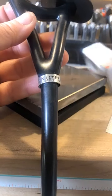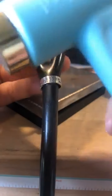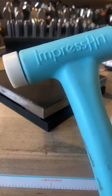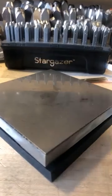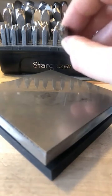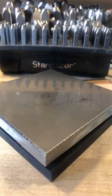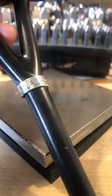The Argo angle hammer — you cannot switch out these heads. This hammer is strictly for metal stamping. This multifunction hammer here is the only hammer that you can put different heads in. The signature stamp set I'm using today is rated for stainless and they're tapered, cleaner, and sharper. Your regular stamps in the colored boxes work just as well on all metals, but you cannot use them on stainless steel and they are not tapered — that's the difference.